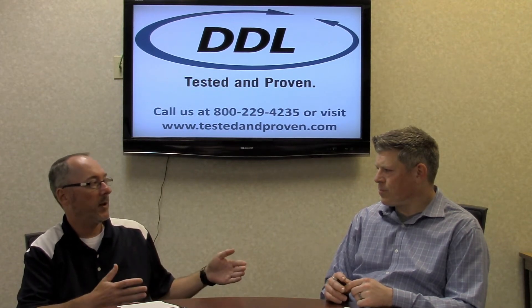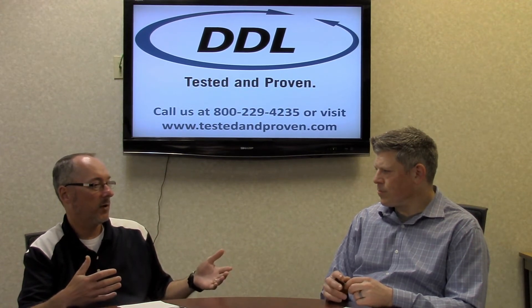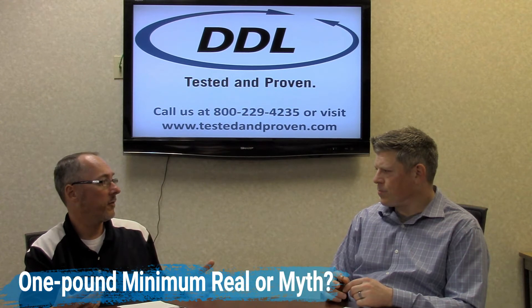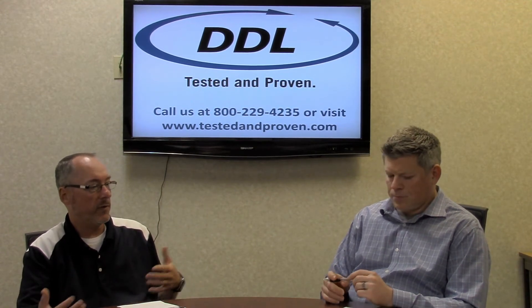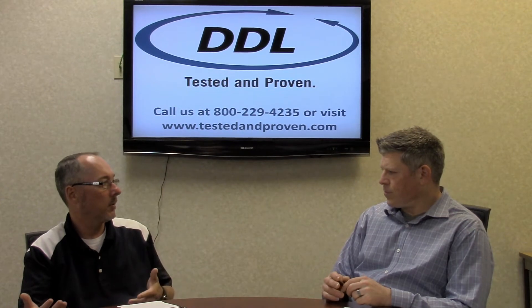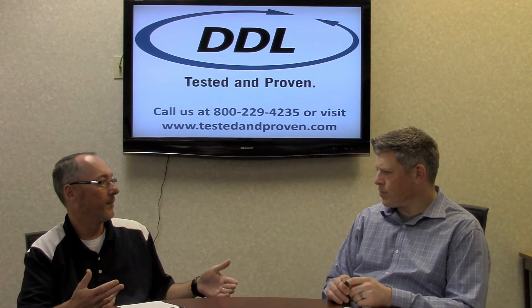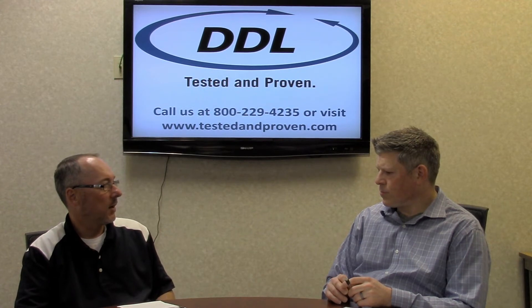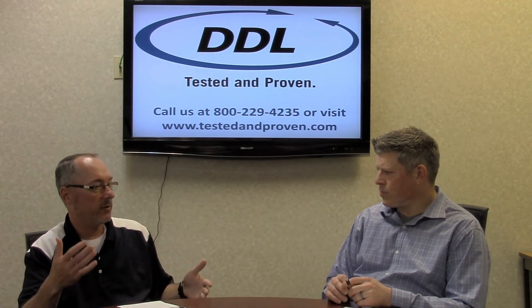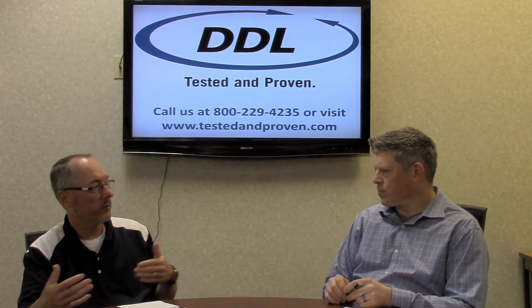So I think we should step back and talk about what one pound actually means — if that's a reality or if that's an overall myth that the industry has created for organizations to latch on to. I've been doing this 25 years and almost every protocol I see has a one-pound minimum strength requirement. We step back and ask where that one pound came from — EN 868 has a strength requirement that, if you go through all the calculations, gets you pretty close to one pound.